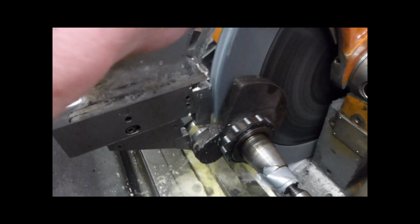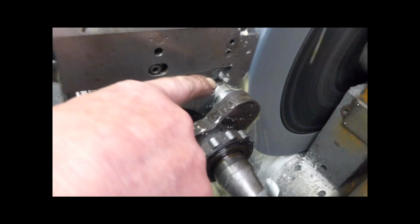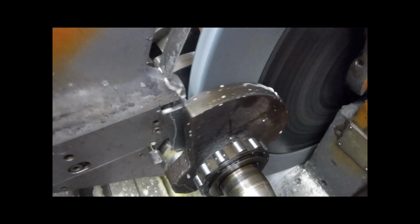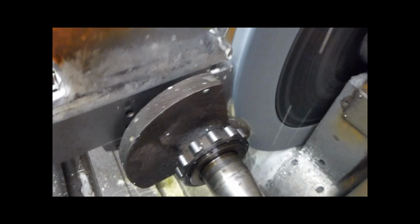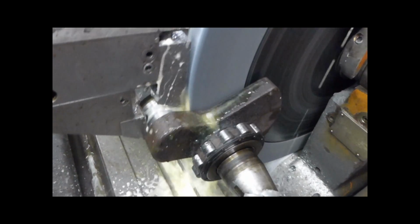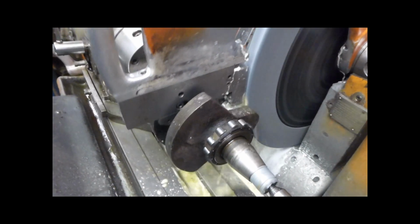That's the coolant. It comes all through that pipe into here, down inside the casting, and comes out in that exhaust. See it coming out there? The suds on it keep it cool. It's most important. If that went hot for a few seconds, that would distort the crank if you were grinding without the suds on there. It depends how much cut you're taking.